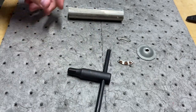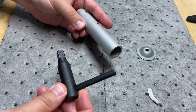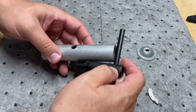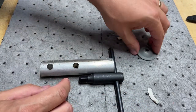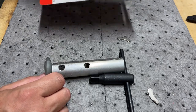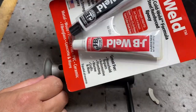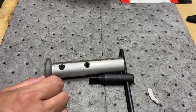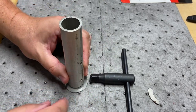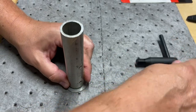I'll call this Mark One. I'm going to use this piece of aluminum, cut it down, and mount it — I'm going to glue the end of this to a base piece with JB Weld. JB Weld beats epoxy when you're talking about machining. I don't have a welder and I wouldn't know how to weld aluminum to steel anyway. I'll use some magnets, put those with JB Weld on the bottom, and it'll just sit upright on the side of the lathe wherever I choose, and the chuck key will just sit in it.